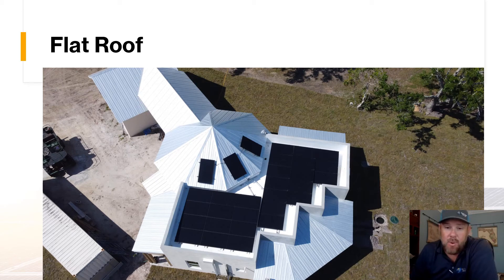There's a little bit of conduit visible, but the footers holding these rails are set into the concrete itself — the foundation of the roof was poured around our footers. Those panels are not going anywhere during any storm. Everything we do is rated at 180 mile-per-hour plus wind zone, and with systems integrated into the roof like this, we're in really good shape.